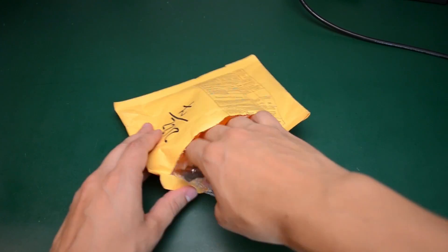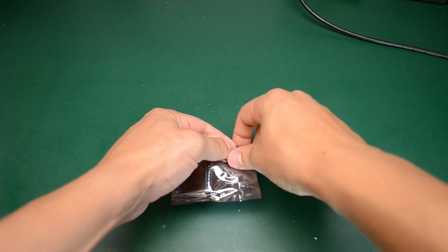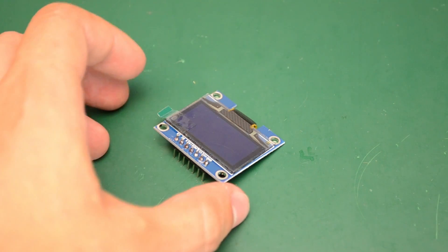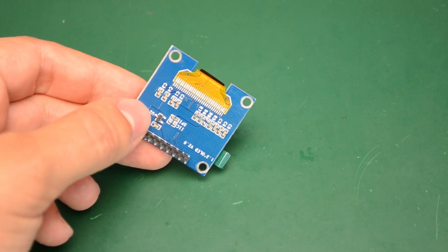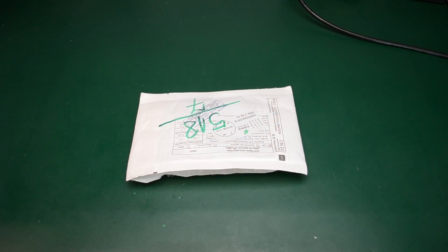Next up in this envelope there should be the 1.3 inch OLED screen. These are very similar to the more popular 0.96 inch ones — they have the same 128 by 64 pixel resolution but the pixel size is slightly bigger, giving an overall size of 1.3 inch resulting in better viewing distance. I used to buy these from buydisplay.com but this time, because I only needed one piece, I got it from AliExpress for $6.40 with free shipping. This display will also be used in my dummy load project. The display has pretty much everything it needs for voltage bias on the PCB, so you only need to provide the control signals.